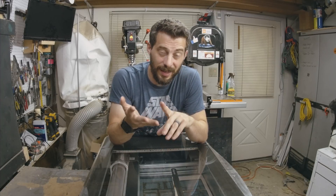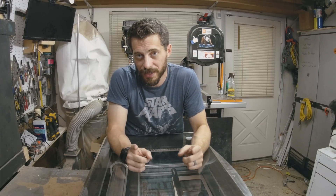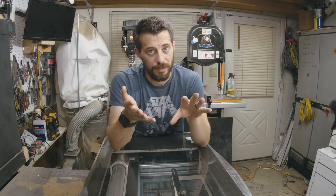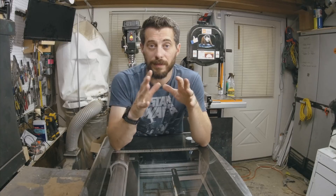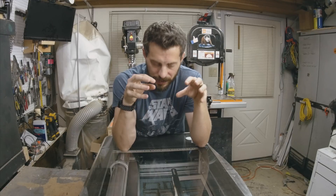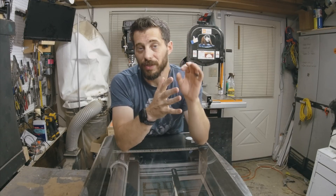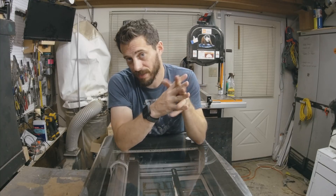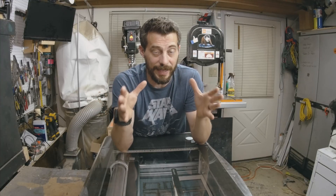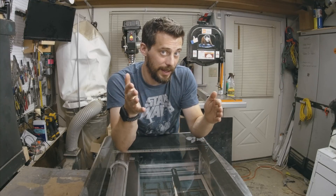The camera is one of the big things that makes this machine unique. Being able to recognize the material on the inside automatically is a huge time saver. There's also a second camera built in which helps it understand not only the surface of things but also the 3D shape. One of the big features is 3D autofocus — the machine understands the height change of an object and adjusts the focus accordingly, so you get a nice sharp engraving over a curved surface. Anything with a curved edge you can actually engrave all the way around, and that's pretty awesome.